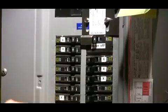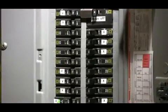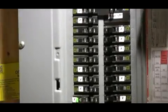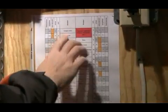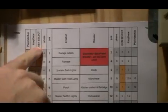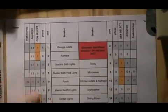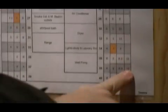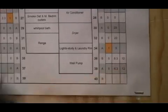I marked them all with X's, and I also took the step of measuring each circuit with an amp clamp ahead of time — with everything I could turn on in the house — to get a better idea of what each circuit would draw realistically in a power outage. I recorded that on this plate here that I made in Microsoft Excel. It's basically a layout of all the circuits in the panel, their positions, and whether I would select them in a power outage — it's called GenSelect — and then the amp draw. In some cases I put the peak draw; for example, on the well pump it starts up at 12 amps and then stabilizes at 6.3 amps.